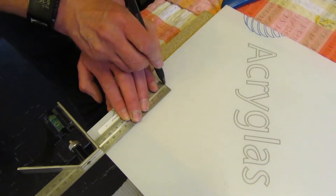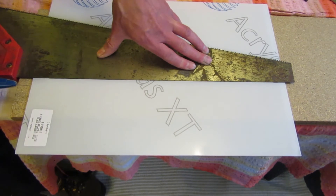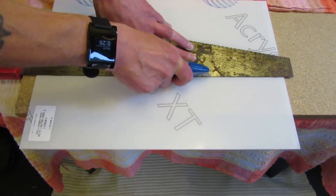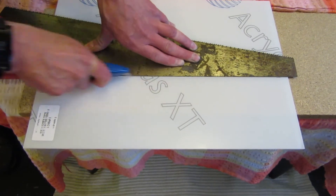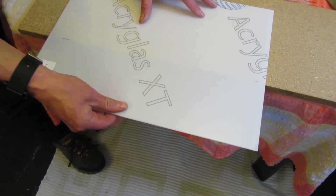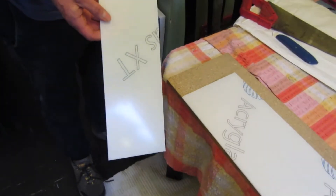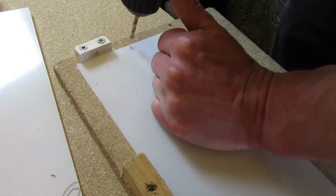The clear back panel was a piece of 3mm thick acrylic. This was scored using a knife along both sides. A sharp push gave a nice clean break. The edges were sanded to smooth them and to get it to the correct size.